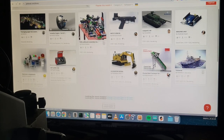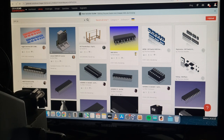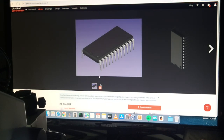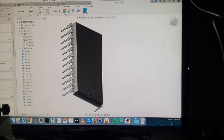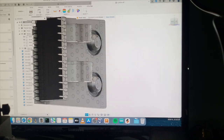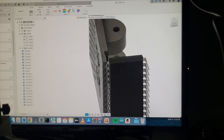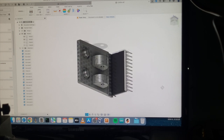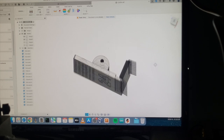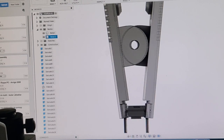As I was not able to find any open source project which I would like to build as an entire series of clips, I decided to try and design my own clip. To design such a tool it's best to do it around a 3D model of a particular IC. To get 3D models of various ICs I usually go to the GrabCAD community website. My design is similar to the Pomona one, as I didn't have anything that could work well as very springy contacts for the 3M-type clip. The clip has contact dividers, channels to insert contact elements, and a metal spring for tension. It also requires a rod or screw as an axis. I tried to make it as slim as possible to work on densely populated boards.